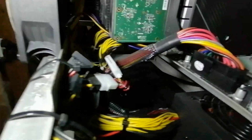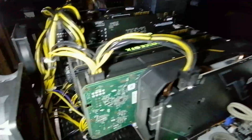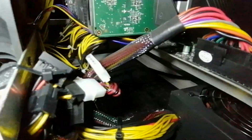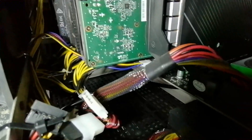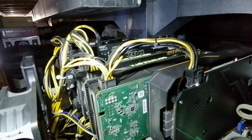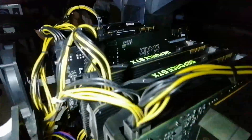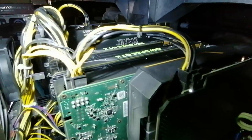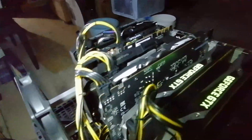This power supply is designed to power this kind of motherboard and 8 GPUs. It has 8 separate 6-pin connectors for the motherboard to supply all the PCIe slots, and it has 4 8-pin connectors — each of which has 2 8-pin connectors, meaning you can supply 2 GPUs per line. As you can see right there, it looks like a daisy chain but it's not — each line is only supplying 2 GPUs, which is the design of the power supply. I've done some power management there. Sorry for the fan noise, but this is mining — you guys understand that.